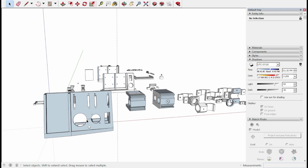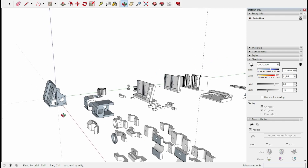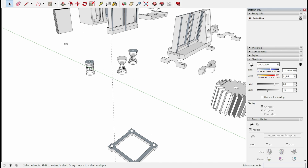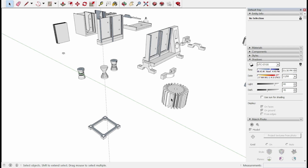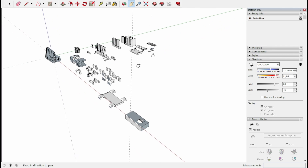When I first started, I decided I would build a little demo station where I could test things out. This one right up front is my original one that I designed so I could get my hole spacing in line. I made a bunch of different connectors because the tubing on the wheelchair and the conduit were two different sizes. Originally, I wanted a friction-mounted wheel for the motor to run on. I started with these little rollers, but this big one over here is the one I ended up going with. The joystick controller design isn't the best — I'll probably adjust this later, but for right now it should get us up and moving.